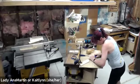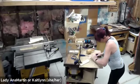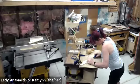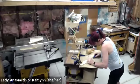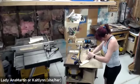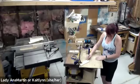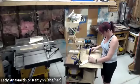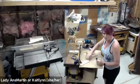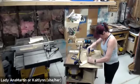When you remove waste, you remove a third of it at a time. Keep yourself from splitting it out. Your first cut is at 90 degrees to the material. After that, you're gonna back bevel just a couple of degrees. Because remember, the end grain in there doesn't have any structural ability. And that waste out.